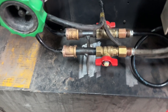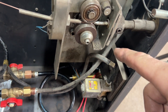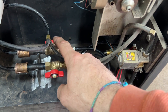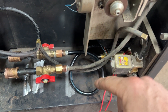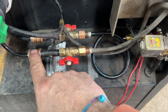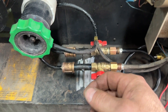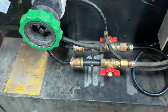This is the first mock-up of everything. I've got all my one-eighth inch airlines connected. The original euro comes down and goes through the first ball valve, the secondary ball valve goes to the spool gun. The solenoid comes up, right-angle, down into this T. I might remake this with right-angle tees or change out some of the pipe threads — I don't really love it and it's rubbing against the spool — but it'll definitely work for now. I'll give it a couple of tack welds on the bottom, then get some pipe tape for the NPT fittings.